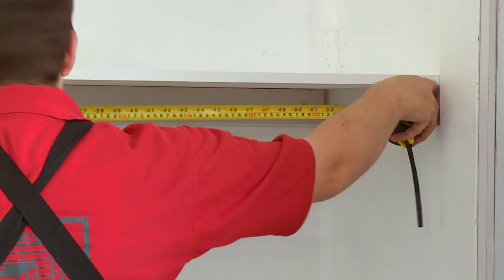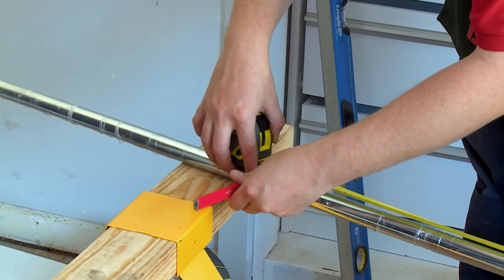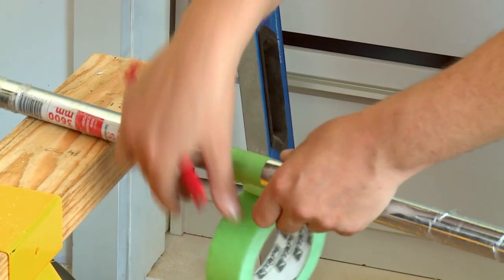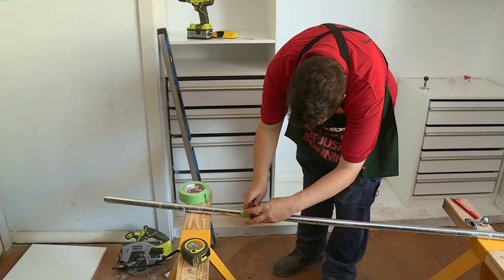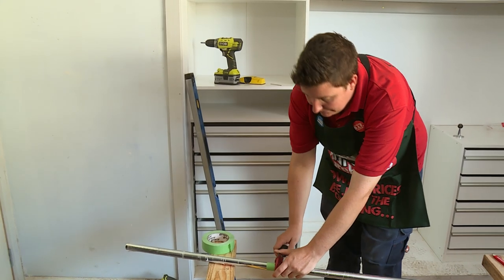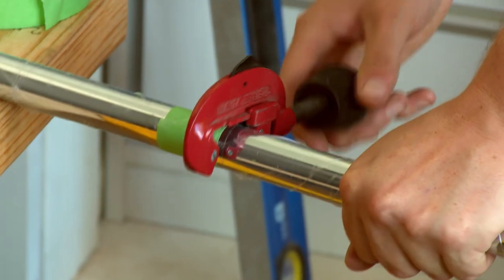Let's measure and cut this rail to size and then we can hang it. When you're using the end caps for your rails, you need to cut the rail 10mm short of the overall length because it sits inside your end cap which tapers off at the end. When you go to cut the rail it's a good idea to use tape of a brighter color because the lead on the silver is hard to see. To cut the rail I'm going to use a pipe cutter. The way a pipe cutter works is that there's a rolling cutting blade at the top and two rolling discs at the bottom. All you do is put it onto the pipe a quarter turn tight with the knob at the back and then just rotate it around the pipe. Each rotation around the pipe you just need to do another quarter turn and keep going until it cuts right through.